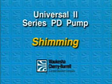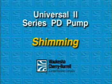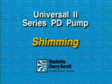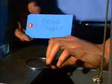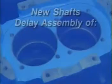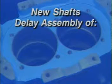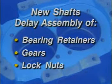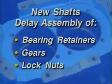The next step involves shimming, which, when done properly, assures the correct front face and back face clearances for trouble-free operation. Of course, if the shafts did not need to be replaced, the shims don't either. Use the shaft shims that you have identified specifically with each shaft. Just remember, same shafts, same shims. If you're installing replacement shafts, you can save yourself time and effort by delaying the assembly of bearing retainers, gears, and lock nuts until you have verified correct shimming. You may need to remove shafts once to adjust shimming before you achieve the proper clearances.